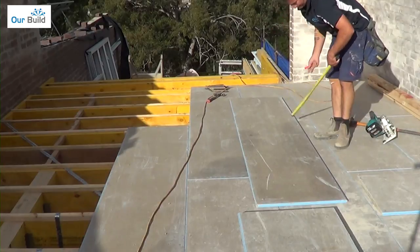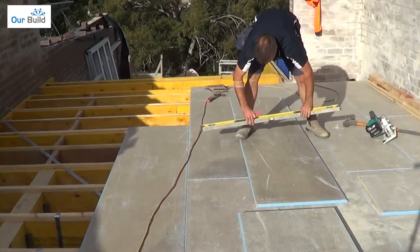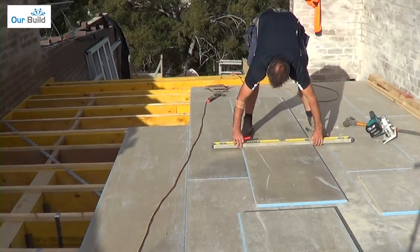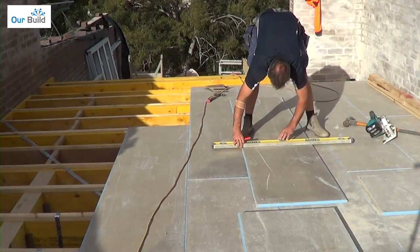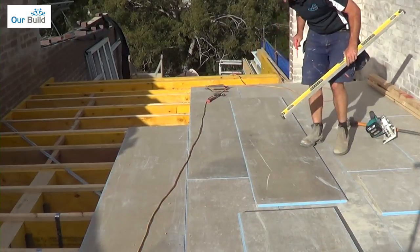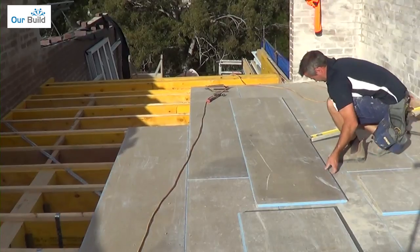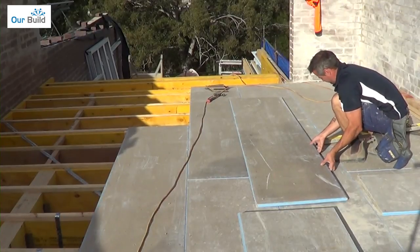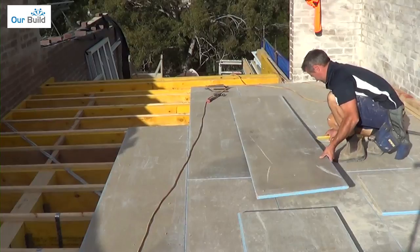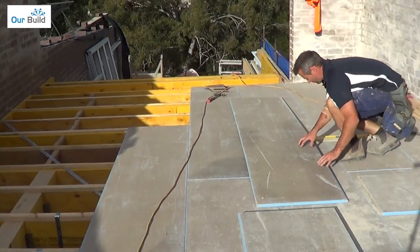The ends of the sheet are square, so if you measure up and get your distance right, it's just a matter of putting a level line across there and following that line. I like to stick the level under there, back under the longer side, and let the small offcut just drop off.